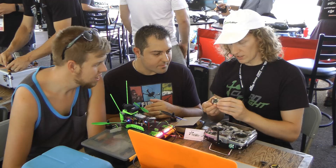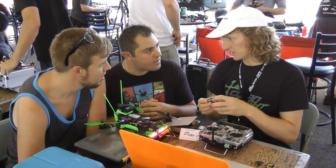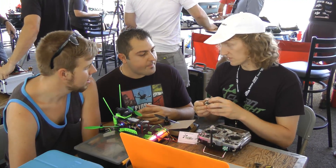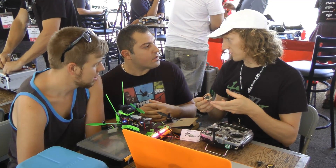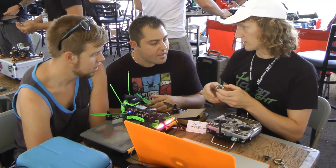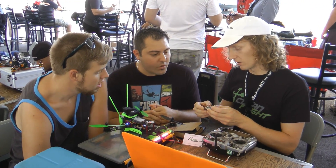At the moment you've got the Naze board out there which has the old F1 processor. This one has the same clock speed but gets more done in the same time — it's 32-bit, same 72 megahertz, but it has a floating point unit on it, which means it's way better at math calculations. It runs the rest of the code quicker, so the loop times are more stable and consistent — no lag, very consistent iterations.